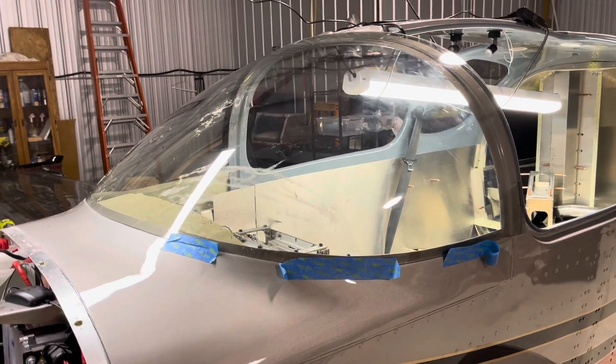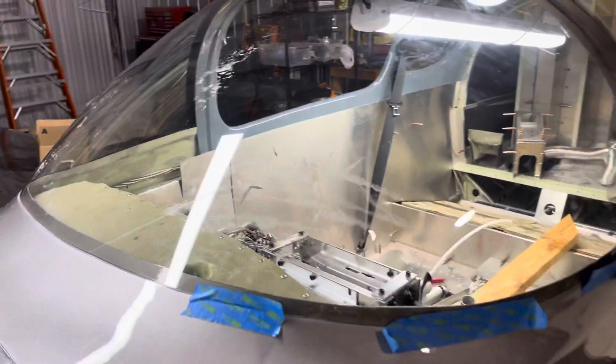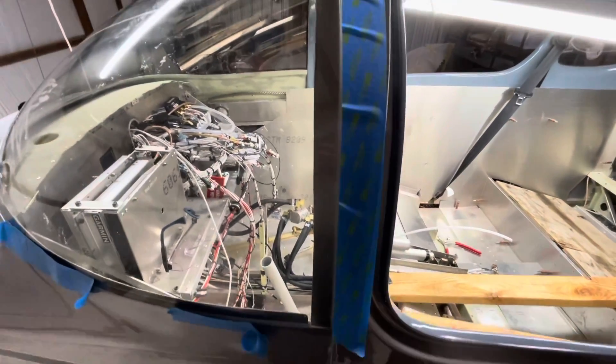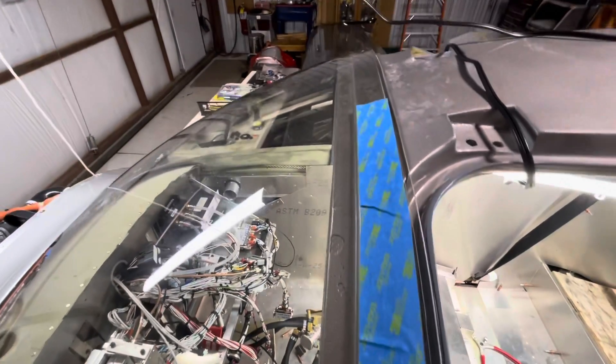Windshield work — I've been trimming off little pieces here and there, just to make it a nice fit along the front edge. I put it down to secure it for now, but obviously we're going to have to trim off the back edge here. All I do is run a line of tape across the top and use the drum to pull it up. Got the tape on, just run that up right along the back edge here to the other side.